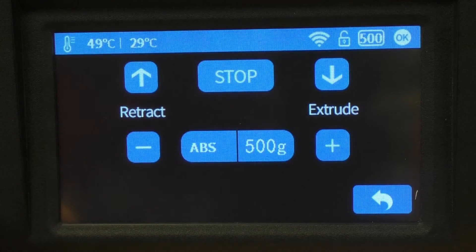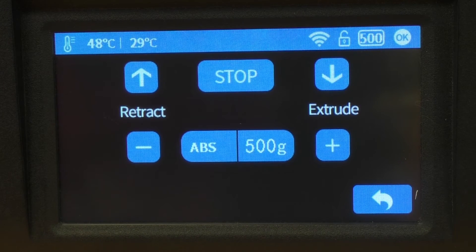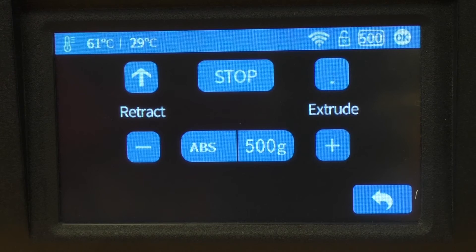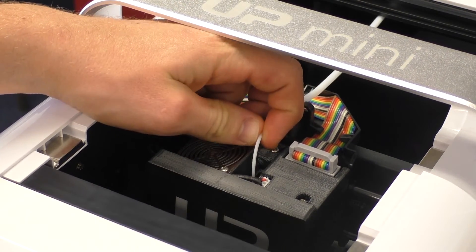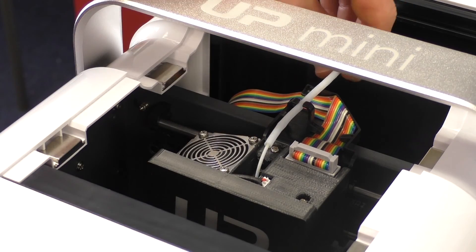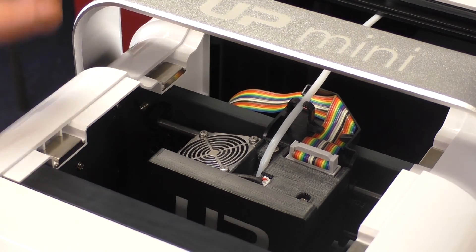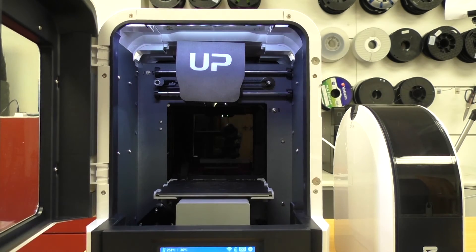Let's go to Material — we've already put the material in our printhead and we need to do an extrude. When we click that you'll hear a beep and that's the printer letting us know the printhead is starting to heat. In the top left corner we've got the temperatures: on the left side is the printhead temperature, which is now starting to raise, and on the right hand side is the platform temperature — because we haven't started heating the platform, that'll stay at about room temperature. The printhead is just about to reach temperature; when it does it's going to start pulling the filament through. Keep your fingers on the end until you feel the gear grab — if it doesn't grab you may have to push in a little bit further. Once it starts pulling the filament through, slot your feeder tube all the way into the printhead, then take your covers and put them back on top. There's the extrusion finished — remove any material that's come out, discard it, and close the front door.